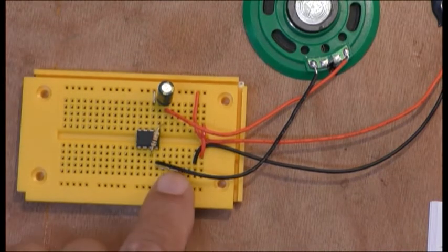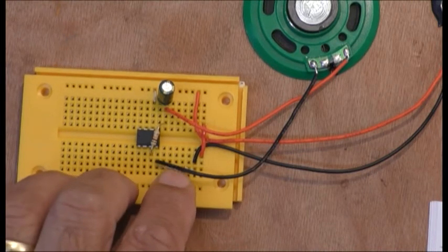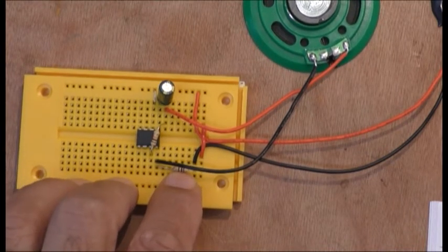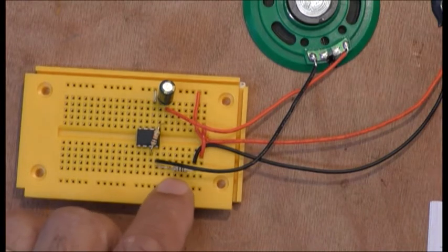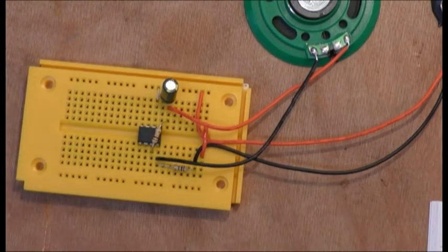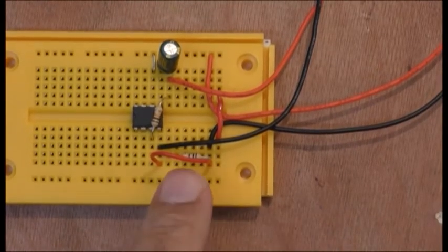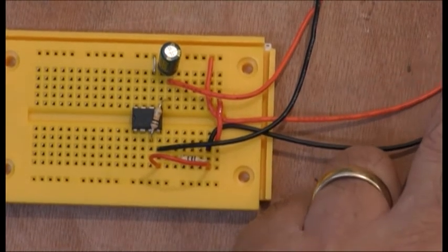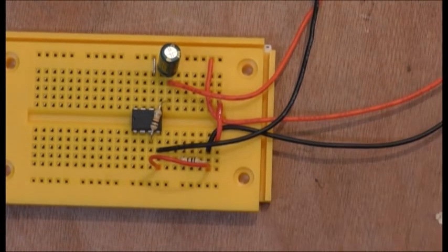The protective 1K, which is here, they say that you don't really need it any longer. When you bypass it with a piece of wire or remove it for a test, the rattling noise becomes very loud. So we're going to put a little pin to bypass this resistor. We're going to short it, in other words. So here it is. I've shorted the resistor because it's working properly, so we can bypass this safety resistor. So let's see what happens then. It's supposed to be louder. That's fine.